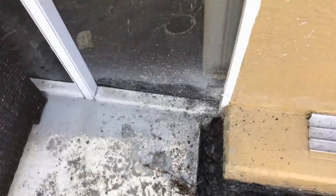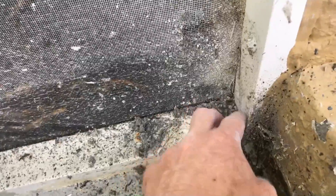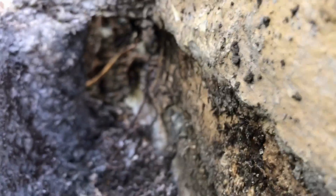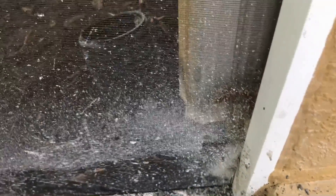Let's take a look at the discharge. Right here there's a screen lanai, a piece of aluminum — strong steel right here. What we do is we just pound out the old channel drain, if you can see that. You see the little tunnel underneath there? We pound that out and we're going to slide our new piece right through there. All it does is discharge right to the outside of the lanai.